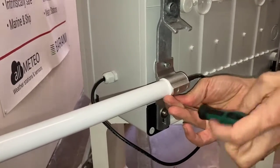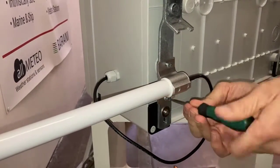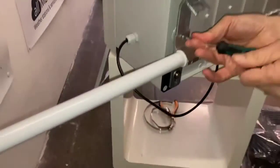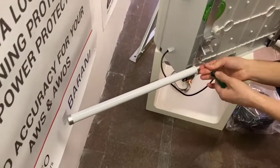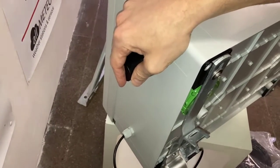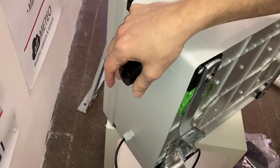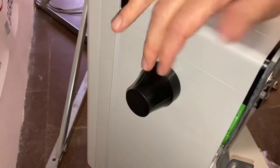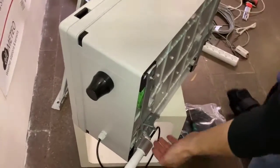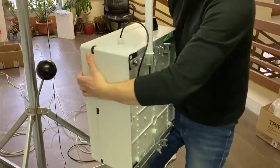The antenna will be very securely connected to the box, and you can mount the whole box with the antenna anywhere you like outside for very strong signal. On the outside you can also see the combined GPS and LTE antenna for the LTE modem — it's a universal antenna with multiple antennas inside, serving the modem. The whole box is now connected, and one person can hold and maneuver it with all antennas connected.